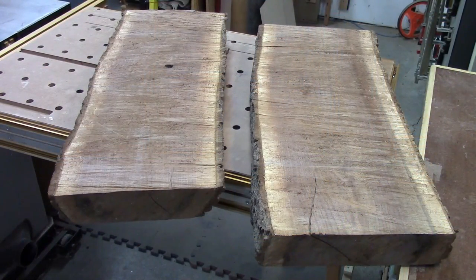These are the slabs that I have to make the leg blanks out of. They need to be a full three inches square. I looked high and low for these locally but I couldn't find them. And when I did find something almost suitable, it was almost $18 a board foot, which is just insane pricing. So I did some searching on the internet and contacted Matt Cremona, and believe it or not he had these just laying around. He sent them to me and these are just beautiful. I should be able to get five legs out of here — I know I can get four. These are a little bit better than 12 quarter, almost 13 quarter. So the first thing I need to do is get the bark off of them.